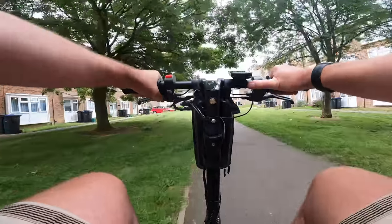Nearly went down a hole! So it's quick - it is quick. The thing with the Phase Runner is once it gets going, because you've got flux weakening which enables higher top speed for the same voltage, it really starts moving like a train. There is not a lot that's going to stop it.